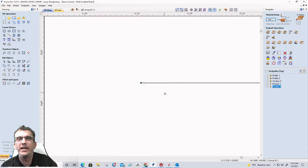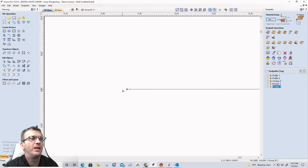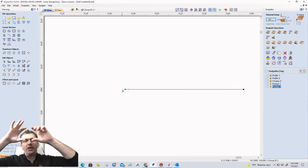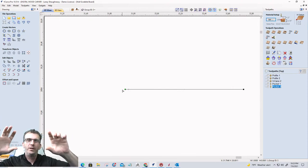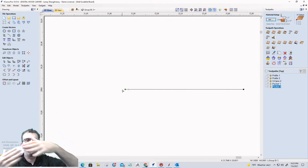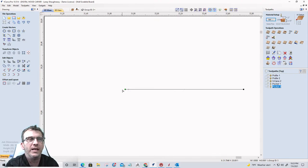And that's how you would hang it. Keyhole slots would be a great way to hang it, or a French cleat. If you don't know what a French cleat is, YouTube it. French cleats are great. Put a strip of wood down at the bottom, and another strip of wood at the top that has a 45 degree cut on it on your wall, with another board with a 45 degree cut hanging outward, so it cleats and it hangs up. A French cleat is a great way to hang this board up if you don't want to use keyhole slots. They're great for hanging all kinds of things, like making tool racks in your shop.